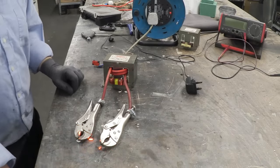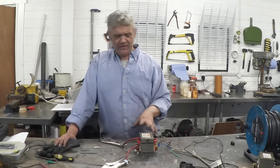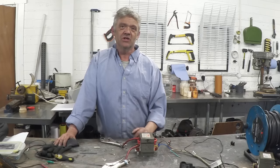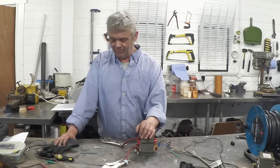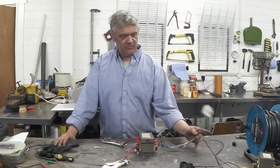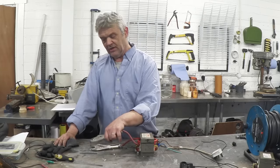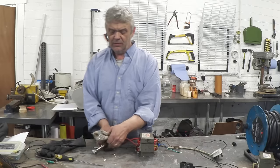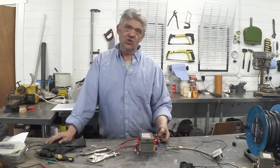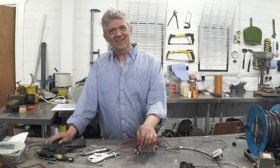I wasn't expecting that! Okay, so that's basically what a spot welder is. If you've tried to make a spot welder and put on the one turn everybody talks about and it's not working — put another turn on. It's only to do with the way your transformer came from the factory. That gets hot enough to weld stuff. All you really need is exactly what you see here: something to plug it in, a power transformer, a suitable cable, two points you can lever up and down to touch and spot weld, and a momentary switch somewhere convenient so you have control over it. I hope it was of interest — thank you very much for watching.